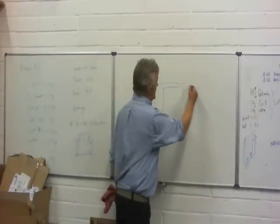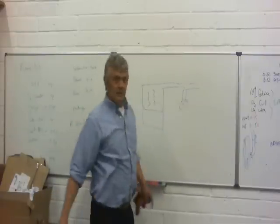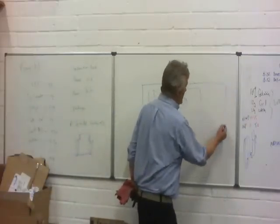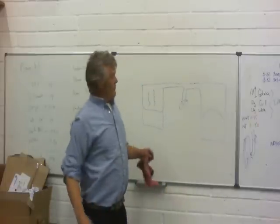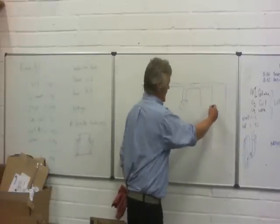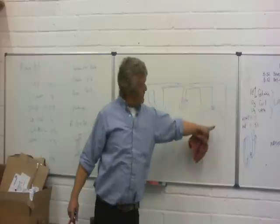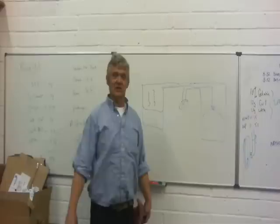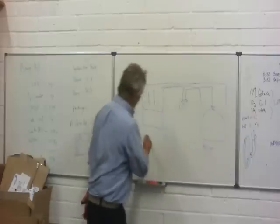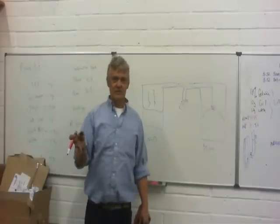That's why we had the vacuum pump. Once we'd pulled that sufficient vacuum and the water was being given off, we shut the vacuum pump off. You would think that it would reach an equilibrium state and indeed it would — apart from the fact that in the second can we had a whole pile of zeolite. That zeolite will absorb water like crazy. So that water vapour finds its way to the zeolite and gets absorbed by it, which equally keeps the vacuum down so that the vacuum pump is no longer needed. That water will continue to evaporate and go into the zeolite as long as the zeolite can absorb it. What happens is the zeolite gets hot, and that can gets hot. That's essentially what's happening in one of these adsorption chillers.